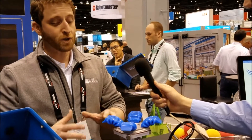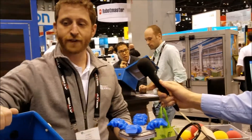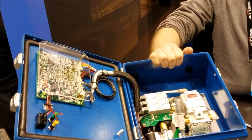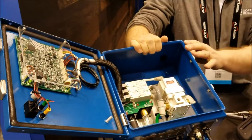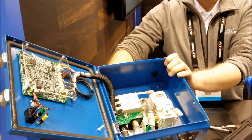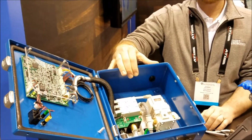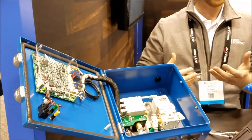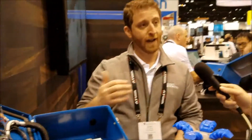There are several other pieces to this solution. Everything about it is plug-and-play. We start off here with our control box — this is what supplies air and vacuum to the gripper. To power it up, you plug it into your robot controller. Any industrial robot: give it 24 volts and a digital I/O communication line to your robot controller, and it can command the use of this box. The box has eight different programmable settings, allowing you to run different gripping profiles — so if you want to switch over to another product quickly, you just command a different pre-programmed setting and it'll have a new grip profile.